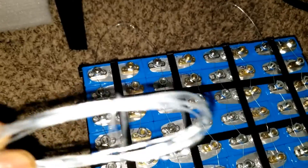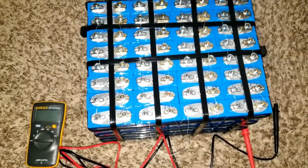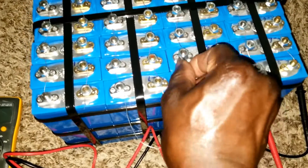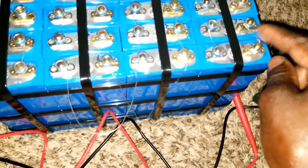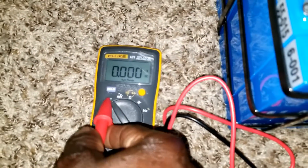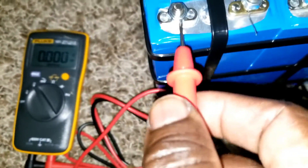Using tiny wires like this — very strong, like stainless steel — I got them from the store. We're gonna put the volt meter here with my Fluke 101 and test from the positive on the left side all the way to the negative on the right. I'll set the probe right there and keep tension on it while using one hand. Turn the volt meter to DC — the V with the little strokes and solid stroke — this is on DC.